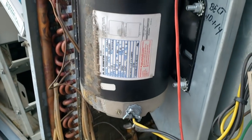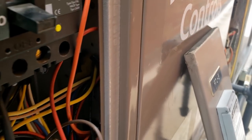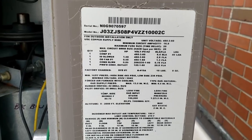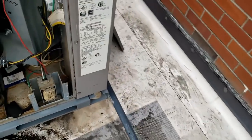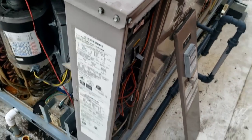This motor's three-phase also, so I'm not going to have it on the truck. I'm going to have the maintenance guy kill the power from down below. I've not worked on one of these units before, so I'm not familiar with it. Does not appear to be a disconnect box somewhere. I wonder if they cut corners and got their contract cheaper so they could not put a disconnect box on it. I'm going to call the maintenance guy and kill power to it.